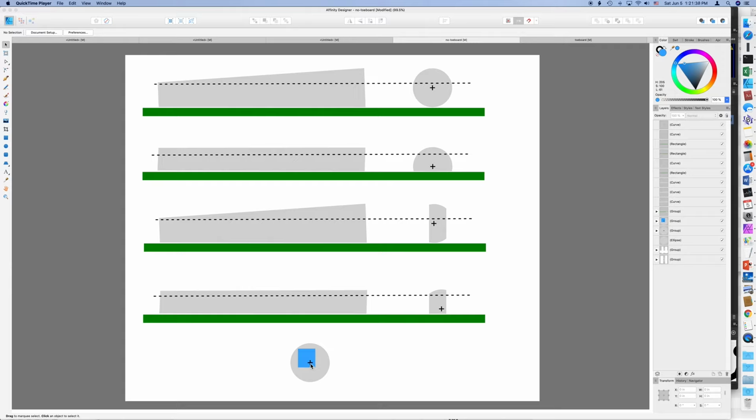First of all, the center of your grain, the center of your rings, your heartwood from the original log is not centered at all on your cant. In fact, it's kind of lopsided. It's down here in one of the corners. And that's really undesirable for the quality of the lumber.